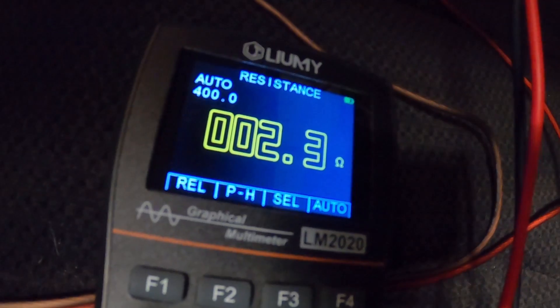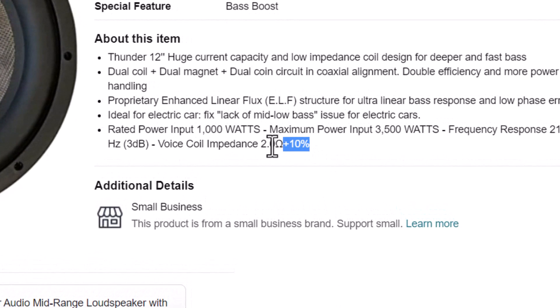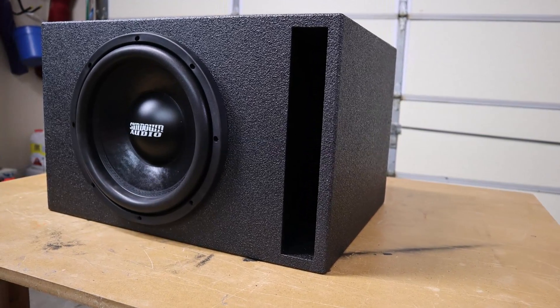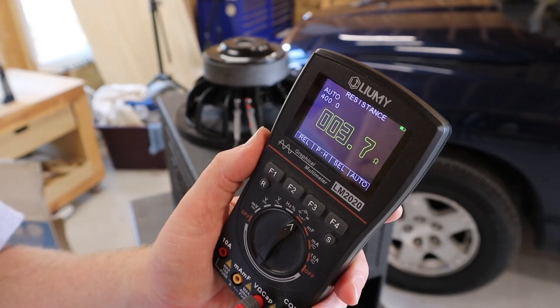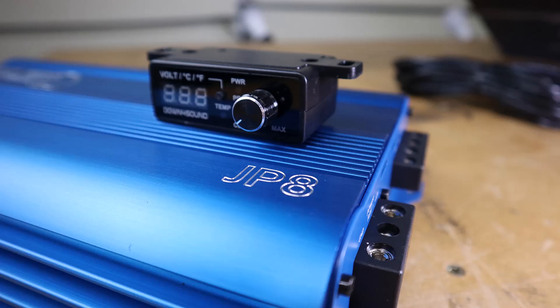Then I realized I had never actually checked the voice coils — so let's grab the multimeter and see if we're getting a one-ohm load at the terminals. Well, look at that: two ohms at the terminals. I think the mistake I made is that I assumed it was a dual two-ohm voice coil subwoofer. Going back to the Amazon product description, it's really unclear. Now, it's common for DC resistance not to match nominal impedance — I have a dual two-ohm Sundown Audio sub on the shelf that reads about 1.8 ohms in parallel. But let's pull this out of the box and measure the voice coils. It's not dual two-ohm — it's dual four-ohm. This is exactly why I'm really unhappy with the technical specifications provided by Light Harmonic. I wonder how many people are out there thinking they're throwing 1,000 watts at one of these and wondering why it's not very loud.